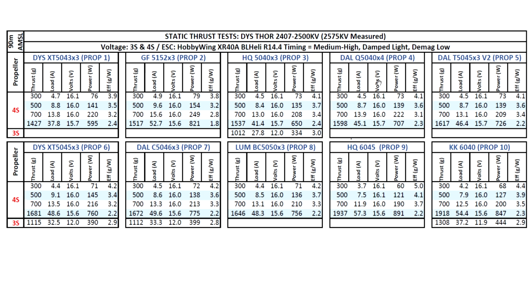Also the voltage and the amps are high because I'm using a power supply, a dedicated power supply. When you're in the air, lipos just can't sustain these high voltage and these high amps. So the limiting factor is going to be the lipo. So your amp load and your volts are going to be lower. Also, the thrust is going to be lower. So usually 25 to 35% lower amps once in the air.